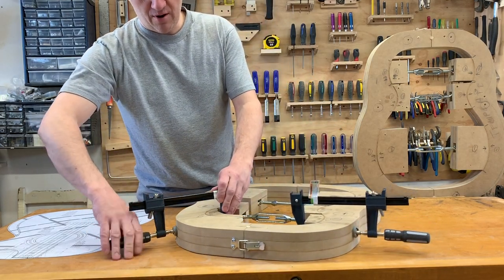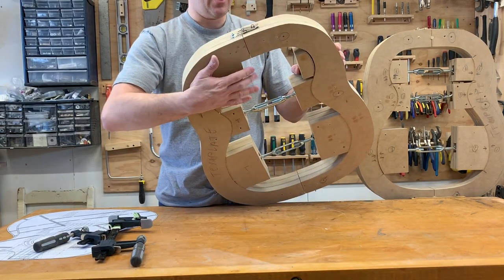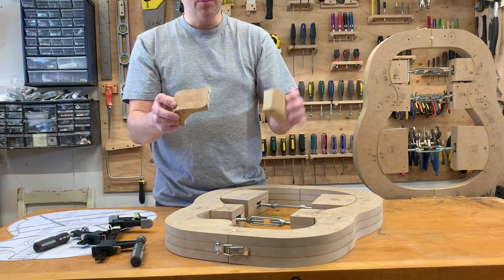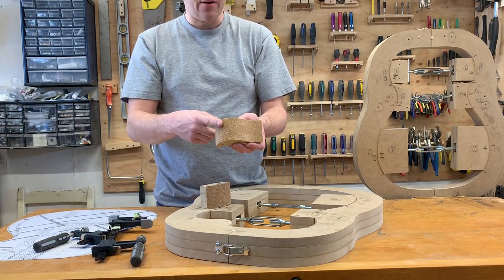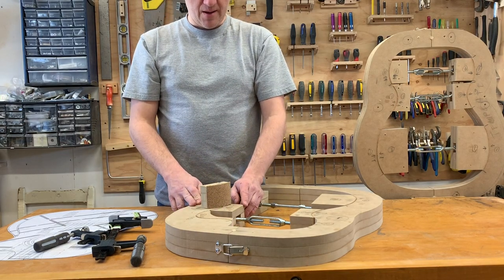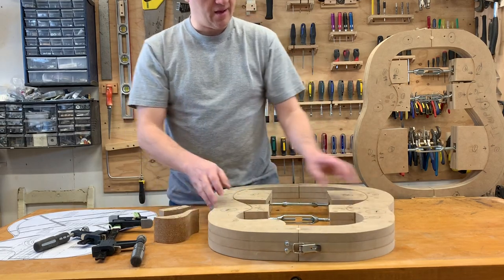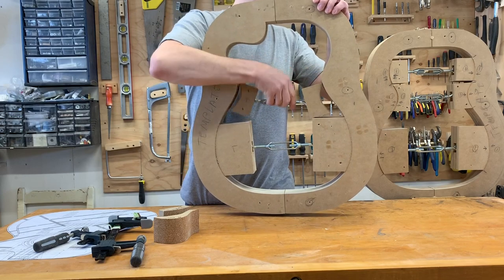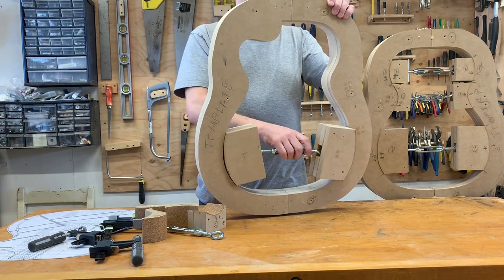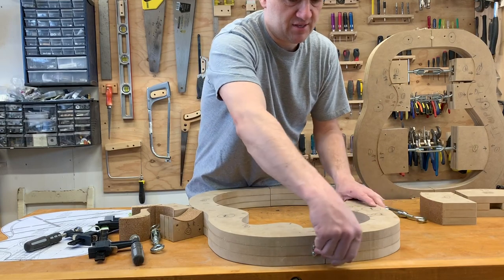So for the cutaway part, I did not build an actual spreader, because there will be the heel block here that would prevent the spreader from being one part. But I did build those two parts, and all my spreaders, by the way, have this lining of cork, which will prevent damaging the sides while I will be holding the sides. So all the spreaders are like that, and the other ones you can just remove by turning this, fold like that. And the mold itself, once you remove all the spreaders, is actually two parts. So you can just unclip this here and here,